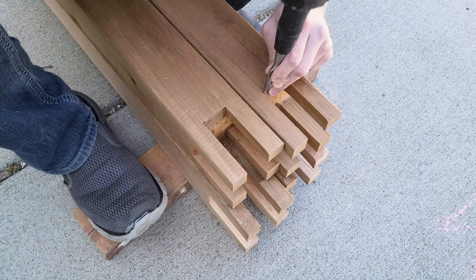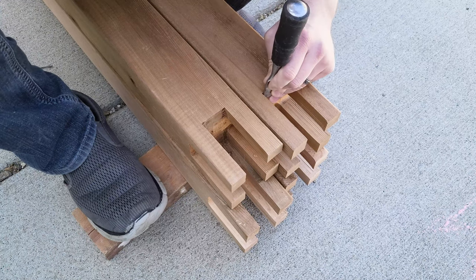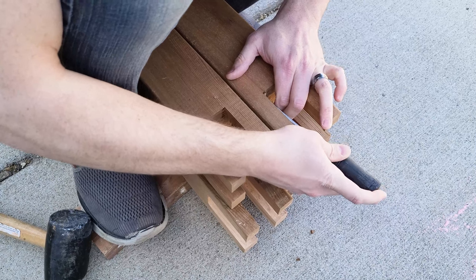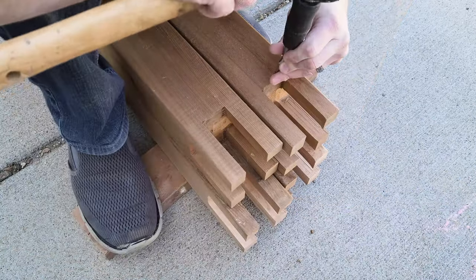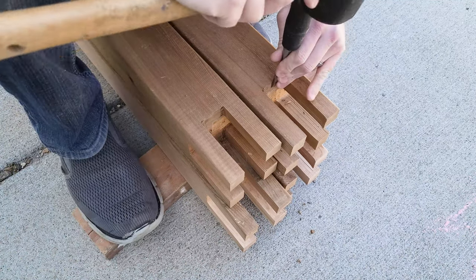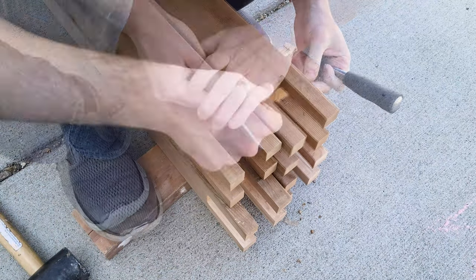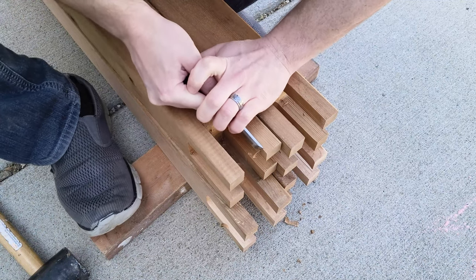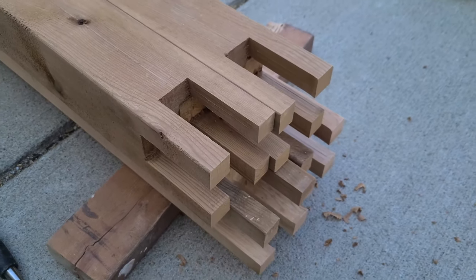It's amazing how much easier these joints are when you use a router — you really should have learned to use one sooner. What tools have you bought that really improved your woodworking and efficiency? Let us know in the comments below. At this point, the castle joints still have rounded corners. We considered putting the same size radius on the trellis crossbeam boards, but decided we wanted a sharper corner. We just grab a chisel and remove the last bit of material to square them off, and then we're ready for sanding.